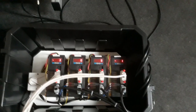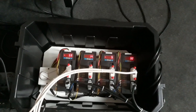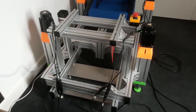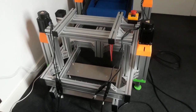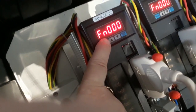Remember that the rotational speed of the actuators is quite low, 1200 RPM, so you won't get thrown around too much. After you are happy that everything is working, set the servo controllers to 3000 RPM and test again.